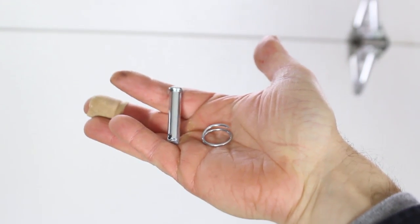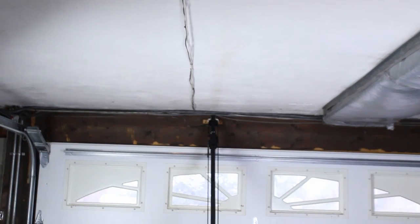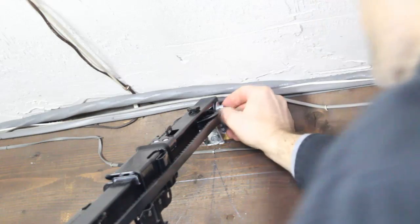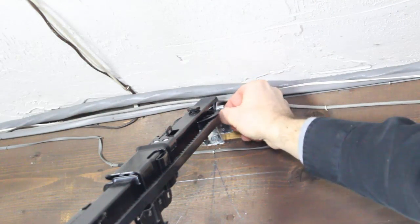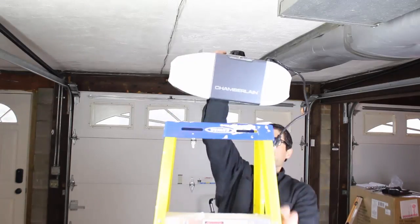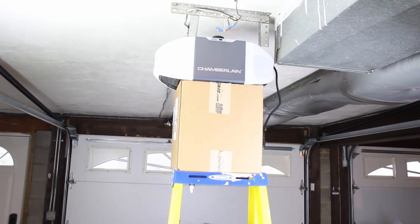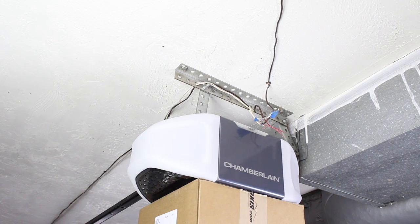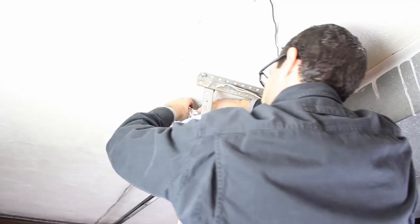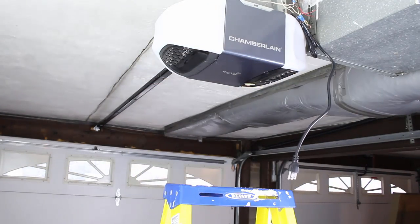Take your clevis pin and ring fastener — you're going to need these. Lean the garage door opener up against that bracket that's on the header. My bracket's a little offset. Take the clevis pin, slide it through the bracket and through the garage door opener, and put the ring fastener in place — this will allow the garage door opener to be nice and secure to the bracket. Place the garage door opener on a ladder, and I was able to put that same box underneath the new one and support it while I repositioned the brackets, sliding them over to the left and right and securing them using my socket wrench.